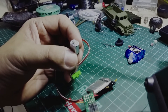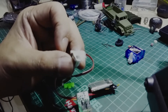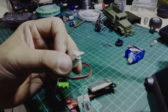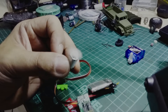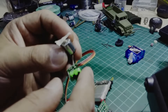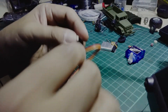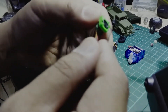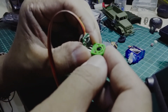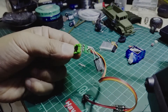Let's verify that everything is working. Honestly, this is already done — you can just put a drop of super glue on the potentiometer so it won't be accidentally adjusted. As you can see, it's already working and the motor can be controlled, going gradually from slow to fast depending on how you pull the trigger of your transmitter. This is already usable as an electronic speed controller for your micro RC trucks or other RC model projects, but it's still a bit big in my opinion.